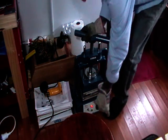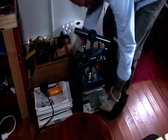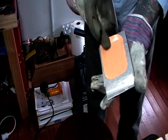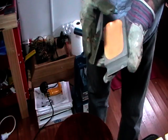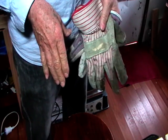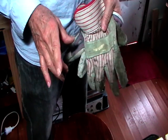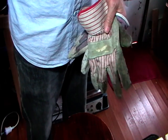So it's been 45 minutes. Switch off the machine. Wear gloves, because this is extremely hot. When you take your sandwich out, if you grab the middle and it comes off, it's vulcanized — it's cooked. If it's sticky and you can't get it off, put it back in and cook it a little bit more. Put this somewhere where it can cool to room temperature — it takes about an hour. As an alternative, you can drop your mold into a bucket of water. It actually says on the instructions of the rubber that that's an alternative. But I'm just going to let mine sit for about an hour — I've put it on the vise so it's not going to burn anything.